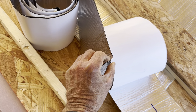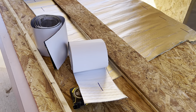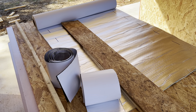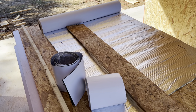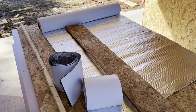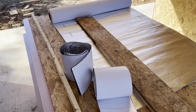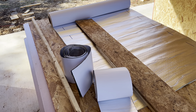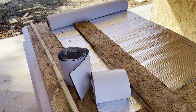On my buildings I only use this foil-faced membrane if I'm going to put all the insulation inside the walls, which I don't like to do. I prefer to put all my insulation on the outside of the walls. If I do that, I can use a less expensive membrane. This membrane is — well, I won't even give you prices right now because it's unusually expensive.